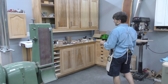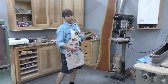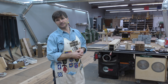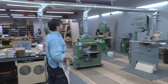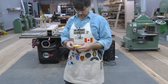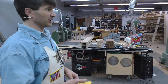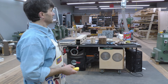These are the cabinets that we built in one of our episodes. I never got that end finished or that door finished — that'll happen eventually. We put in a new dust collecting system. This is an Oneida — I don't remember the model number, but it's the largest you can get that's single-phase. It's called Hi-Vac. It's 5 horsepower and it's in the other shop, but the amount of suction is amazing. We recently got the remotes, which is great. We spent a little extra money and bought the baffle — I couldn't believe how much it reduced the sound. You can carry on a conversation while it's on. It's powerful enough to run every machine at the same time, and we have blast gates on everything to increase efficiency.